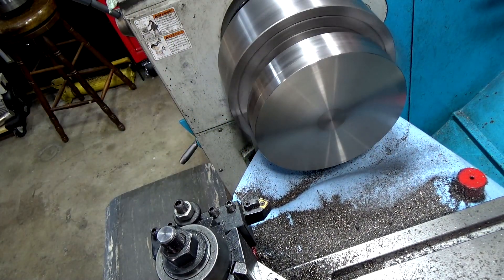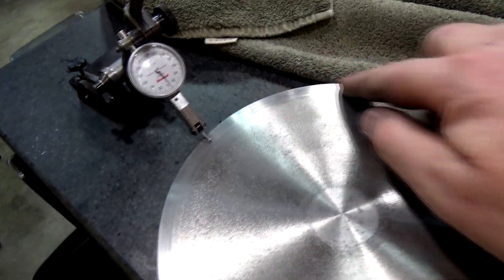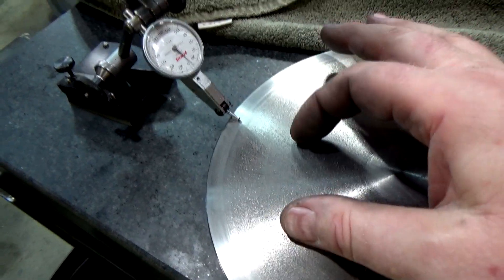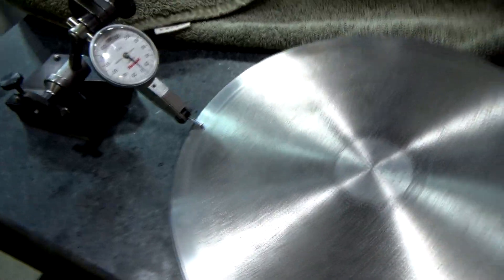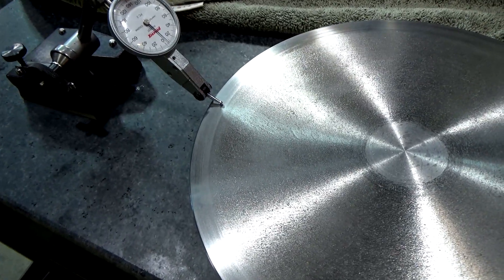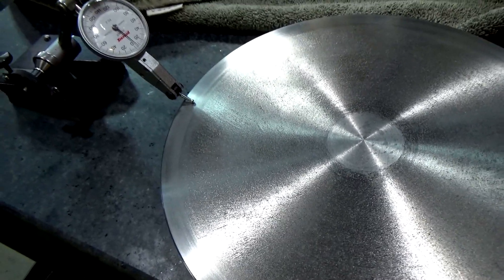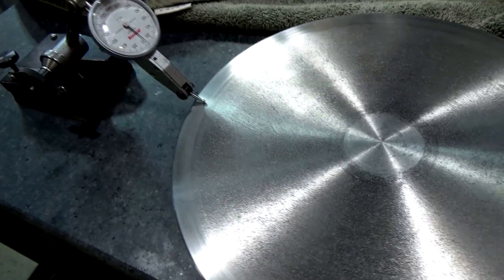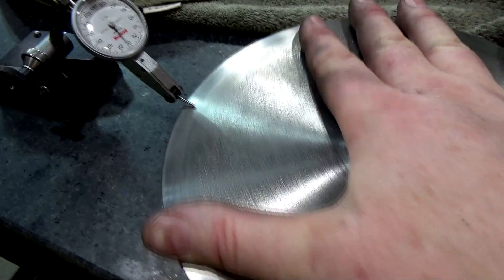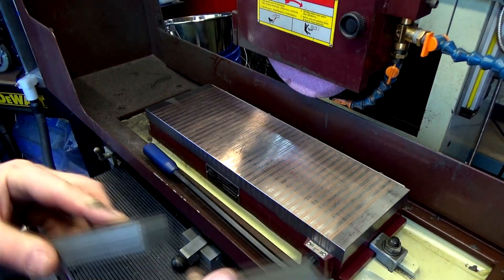This one should be ready for surface grinding — two more to do. I got a horrible surface finish in the middle of this one at the low feed rate. The high feed rate on the back is actually much better. The outside edge where the surface speed was highest did okay, until there was some adhesion on the carbide insert — I found bits of cast iron stuck on the carbide, so they were probably dragging across. The higher feed rate seems to fix that. This indicator reads 0.002 millimeter per division — roughly 75 millionths per division. It actually did a really good job of keeping things parallel. Next up we're going to surface grind the plates, and this is where the precision ground flat stones really come in handy.